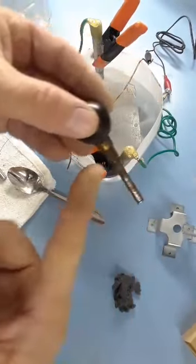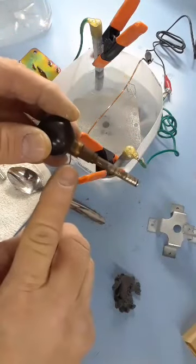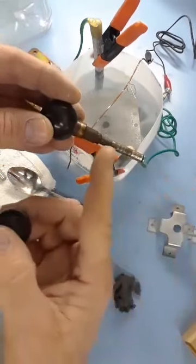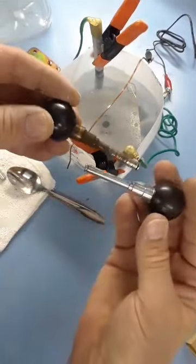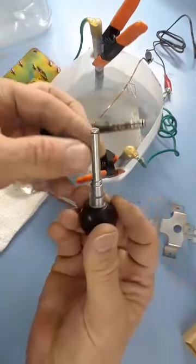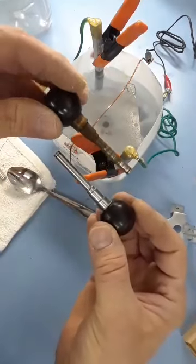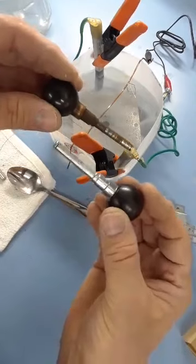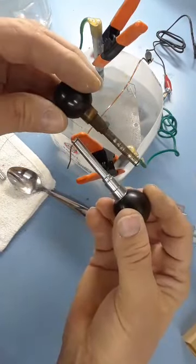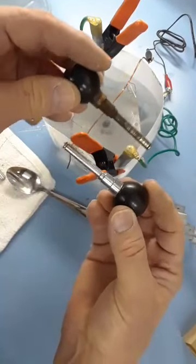There's no excuse anymore not to restore these — unless they're so far grooved that they're just not worth it. But even then, you can stick them on the lathe and smooth them out and restore them to something that looks really nice. And if the plating doesn't hold up, you can re-zinc it later — very simple, half hour.